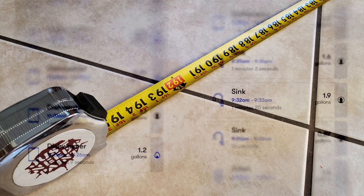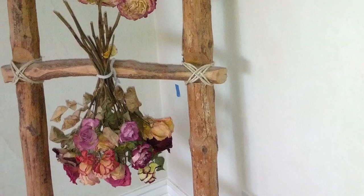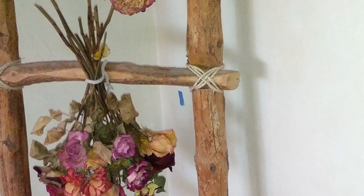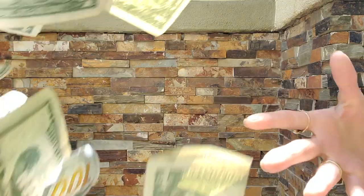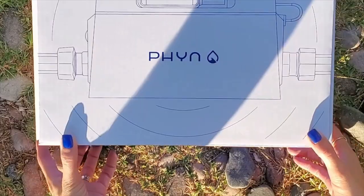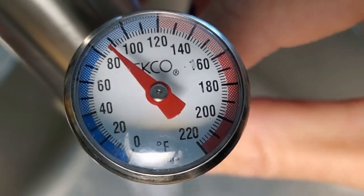16 feet away. But I will say, due to a leak under the slab, we know the plumbing takes a meandering route past the kitchen entirely, only to make it back through the pony wall to the kitchen sink and dishwasher. Depending on how often you use your dishwasher, and if indeed you do preheat the hot water line to the dishwasher, this could be a big hit to your electricity or gas budget just from running your electric or gas water heater for no good reason. This was all a very disappointing, haphazard discovery.